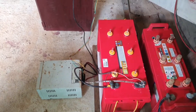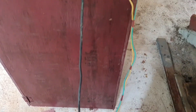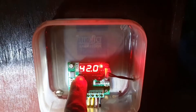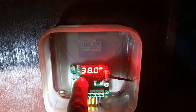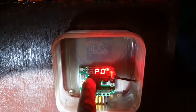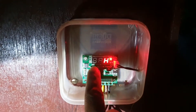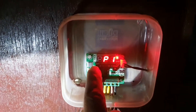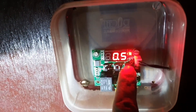I just finished all the wiring. The temperature controller is on now and we will set it up. There are three switches: SET, minus, and plus. Press and hold the SET button until you get P0 on the display. P0 is the operating mode — you can choose between cooling or heating. Press SET then minus to select heat. Press SET again and plus to move to P1. P1 is the differential value between the on and off temperature; I've set P1 to 0.3.